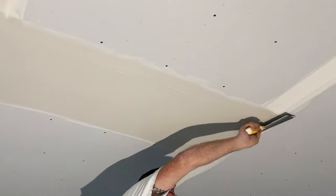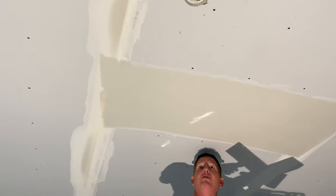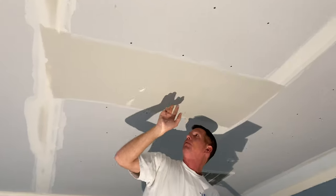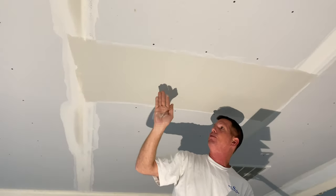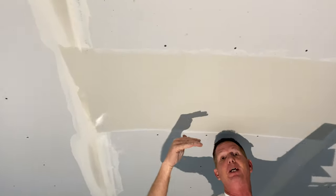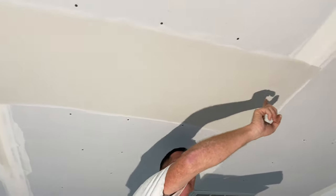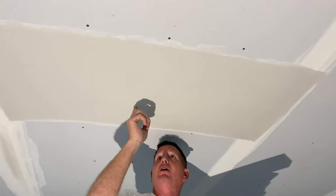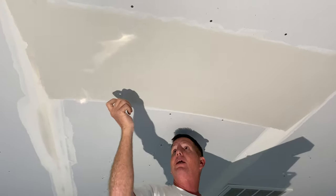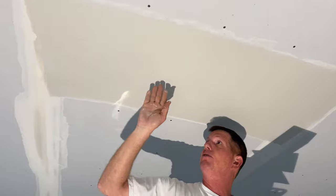It's the same thing — we'll just lay that down nice and flat. So what you do is you're leaving your lap mark outside of center. If you leave it on center, it's going to make that hump bigger. I've got my lap mark just on the outside, in between the edge and the middle. You don't want that in the middle. If you do, you can re-wipe with the 12 and then lay that edge down, that lap mark — just make sure it's off center.